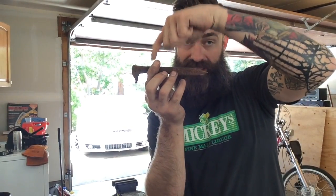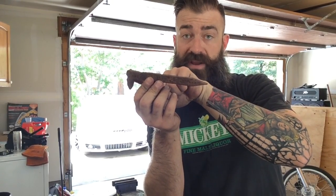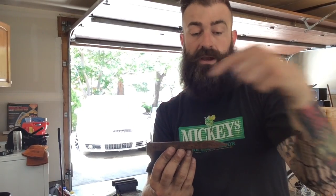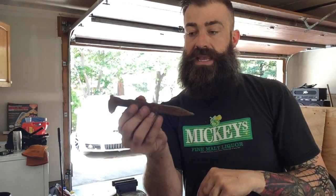I don't want to heat either one of those parts very much because I want to put a twist into the handle. So I think what I'm going to do first is put the twist into the handle, then hammer out the ring for my finger, and then hammer out the blade, because it'll be going from the least vulnerable to the most vulnerable, and then I'm not at risk of messing up my ring or the blade as I'm heating the handle to twist it. So that's what I'm going to do first. I'm going to polish this a little bit, get some of the rust off, and heat up the center part, twist the handle, and then start working on the ring. Let's get to it.